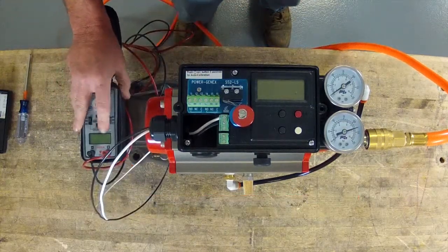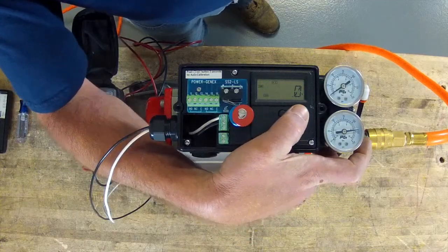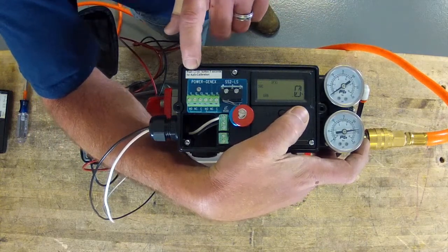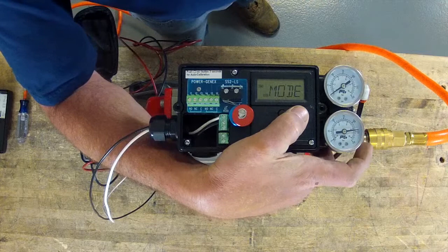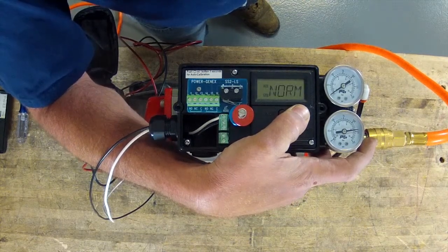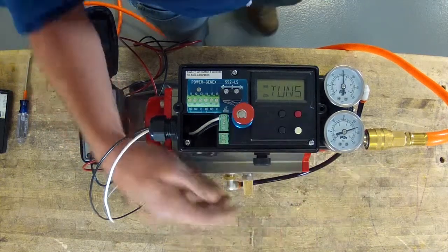Turn on your 4 to 20. Now you just reach around and hit your MO button — that's your mode button. It tells you on the other side of your positioner that you hit that to auto-cal it. So you hold that for 5 to 7 seconds and let it do its thing.